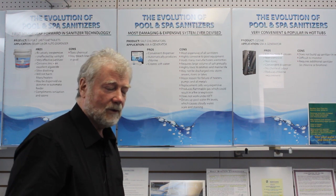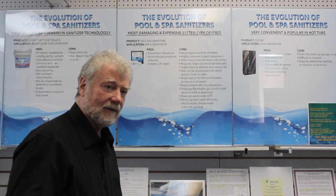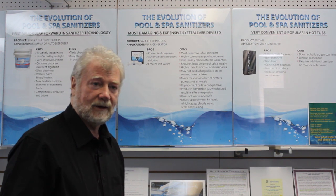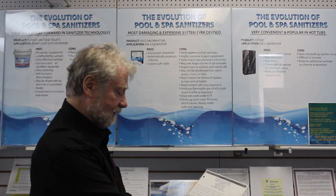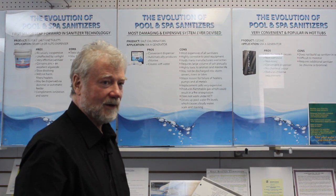What really bought us off salt systems was a few years back, we had a customer who had a salt system on their pool. They went away for the weekend and left their pump running. While they were away, something floated into the skimmer and blocked the water flow. When they got home Sunday night, they found their salt chlorinator had exploded. We phoned the company and said, what's going on? They said, you've got to read the fine print. Warning: operating the salt chlorinator without water flow through the cell can cause a buildup of flammable gases, which can result in fire or explosion. That to us was, hey, I don't know if we want to be selling these things anymore.